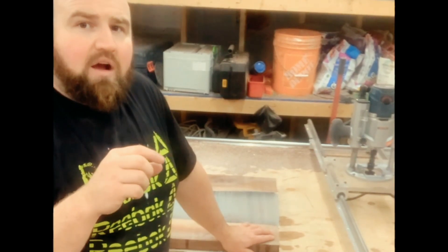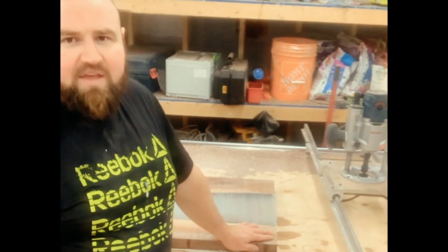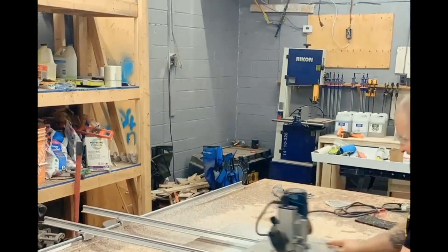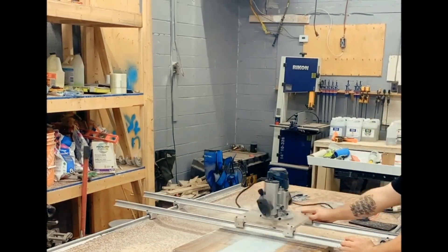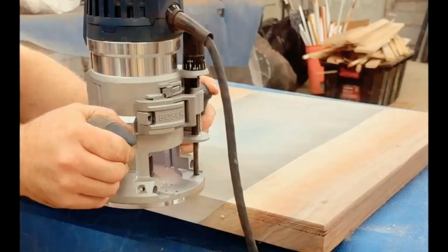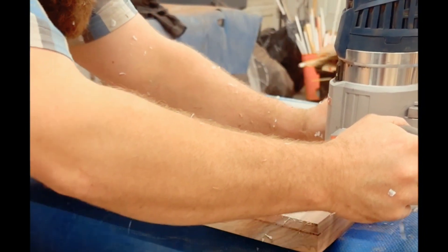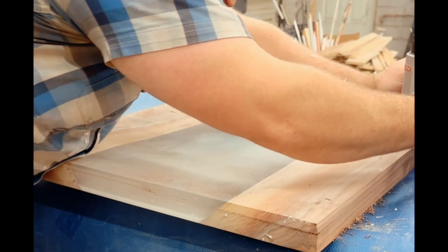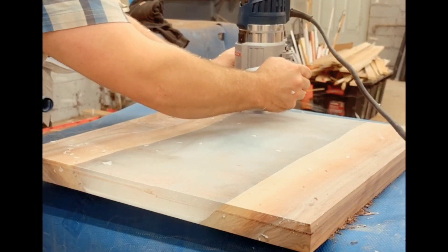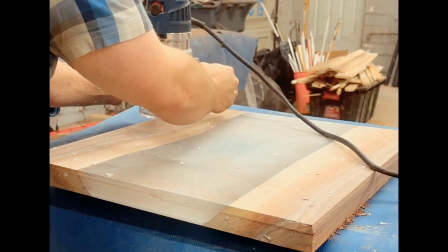Because this has the sides visible, we have to be careful we don't mill too deep — or we can mill right through that ice layer and destroy basically everything. When milling through epoxy and wood, I only like to take about a sixteenth of an inch pass at a time so I don't burn out my bits. Going thicker on the epoxy can cause tear out and chip out. Out of the mold the back is generally flat enough to mill the front side, then flip and mill the back. Once milling was done, I squared it up and cut it to final size, hit the entire thing with 80 grit sandpaper with the Rotex, then took a 22-degree chamfer bit and put a chamfer around the whole top of the table — not something I normally do, but I wanted to try a different look.